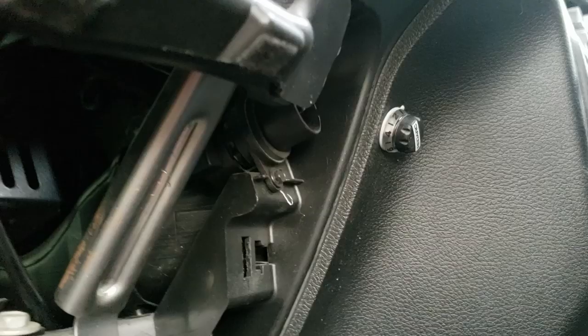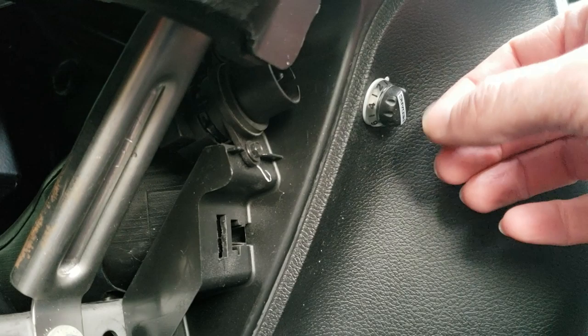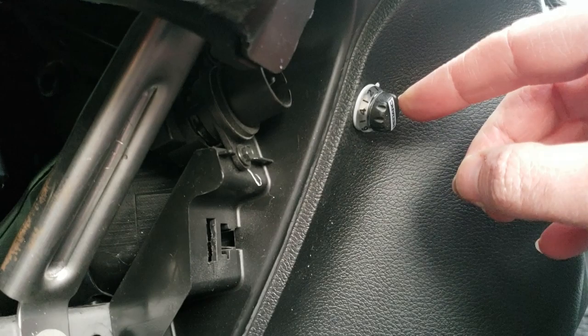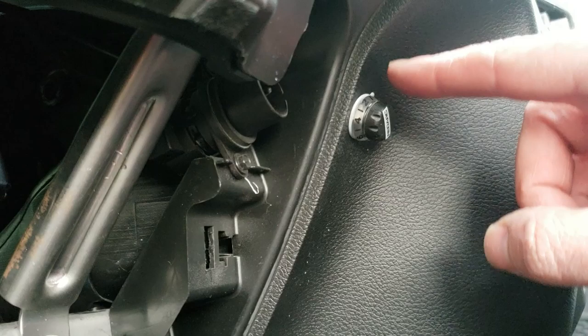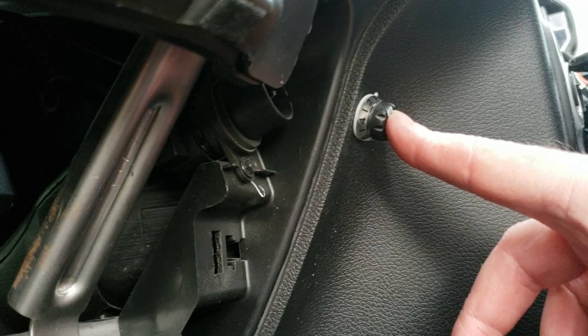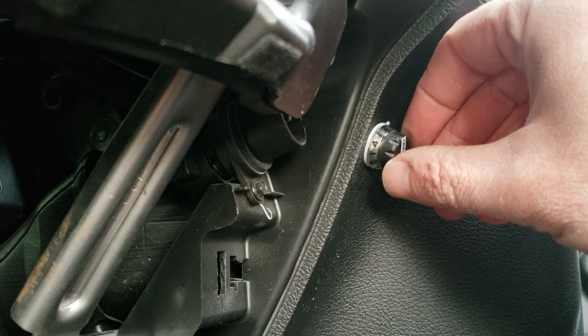One other little thing to mention: when you're screwing this on, imagine the knob is not on yet and you're just threading your nut down. See that little tab on the top of that white ring? Obviously that has to remain pointing straight up toward 12 o'clock. There's a little hole there for the LED light to shine through, and that hole has to remain over the LED. So when you're screwing that on, don't let it twist around on you — keep that tab straight up. When you go to slide the knob on, turn the piece behind it all the way counterclockwise as far as it'll go. Then push the knob on with the zero facing directly up toward 12 o'clock. Push it on and make sure you can push it in and let it click — that's how you go through the different modes.